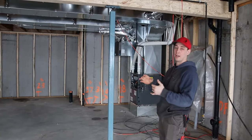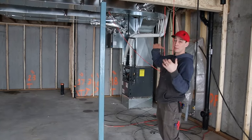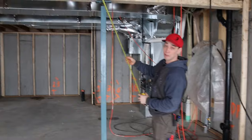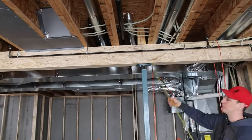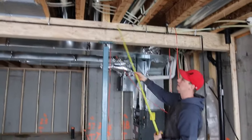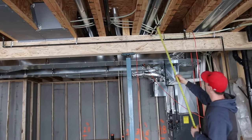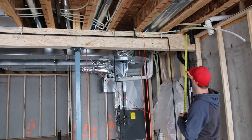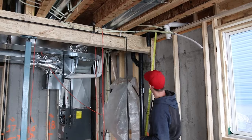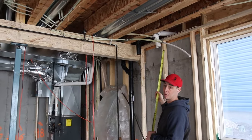Now we're in the basement. This is where we're going to tie everything in to where the hot water tank goes, run our hose bibs, and so on. Again I start with my three-quarters and start doing my planning. The mechanical room starts here — I tried to put my water lines up in the air, but they ended up dropping a gas line down anyway. So I drilled a few extra holes and got them over into the mechanical room. Our three-quarters run over here and tee into where the hot water tank is going to go. This particular builder wants to see 1-inch pipe coming from the main feeding the hot water tank, so we had a 1-inch pipe going over to the main water line. We put it on an air test because it's freezing temperatures right now and we don't want any water in there to freeze.